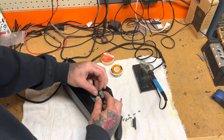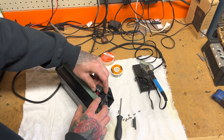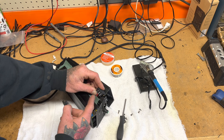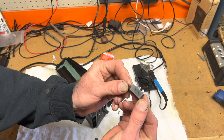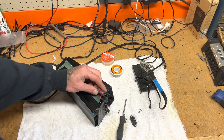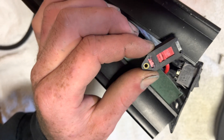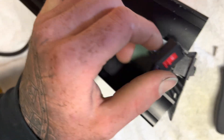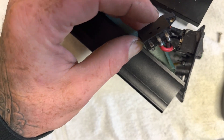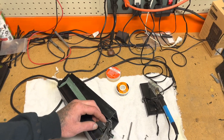I'm going to go ahead and remove the tape I have on here. The switch in the charger has three sets of poles, and the new one also has three sets of poles, so I'm going to solder it in exactly the same way. As you can see, one ear is broken off this one — it was just worn out, which is odd because I never used this switch; I'm always running 110. But we're going to replace it and that's going to get the charger back in business.